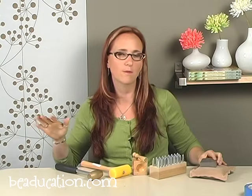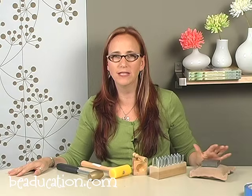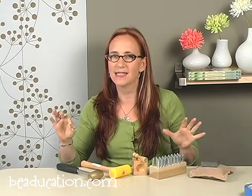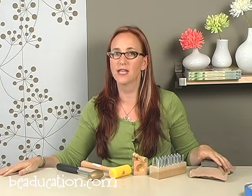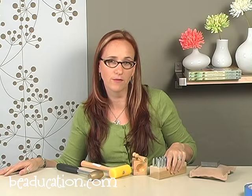Along those lines too, make sure the table that you're working on is very stable. If you're working on a wobbly table, it's going to cause the stamp to kind of jump and get that double impression look. So make sure that your table's very strong. One question we get a lot from customer service is, well, we get people calling in saying, it's not working, help me through.